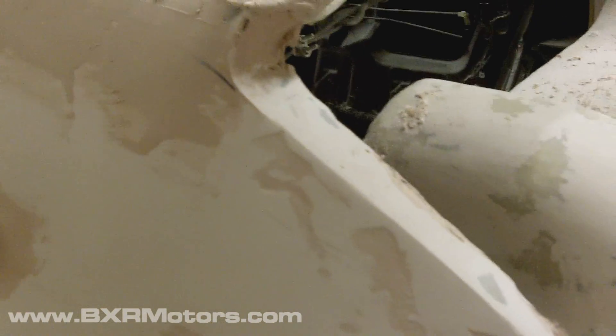Still a lot of shaping to do. I'm going to get rid of this wire thing that's sticking out — it's hard to explain, but if you look inside there's a little turnbuckle and it allows us to keep the top from bowing out when we apply the resins and fiberglass. The resin will tend to shrink and it'll cause the piece you're working on to start to bow or bend or act weird. So that little wire helps keep the top supported where we want it, and it seems to be working, but now it's time to cut it out.